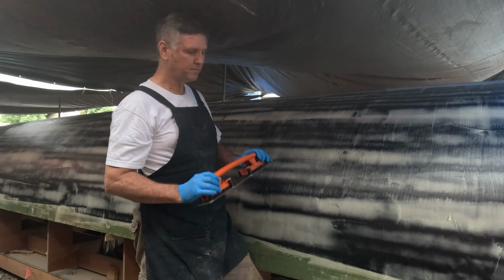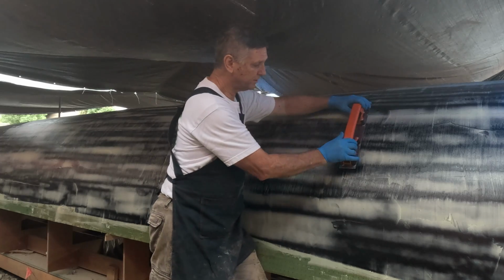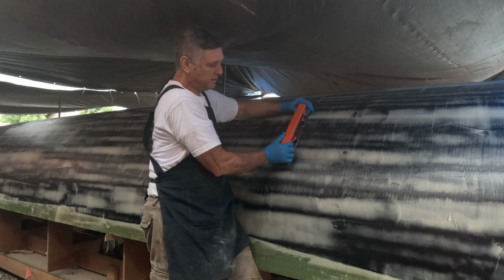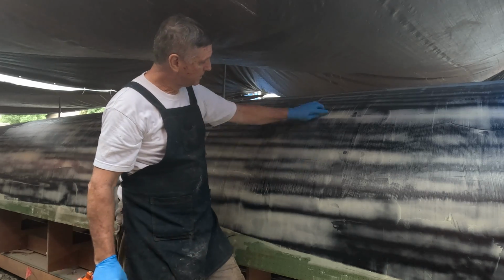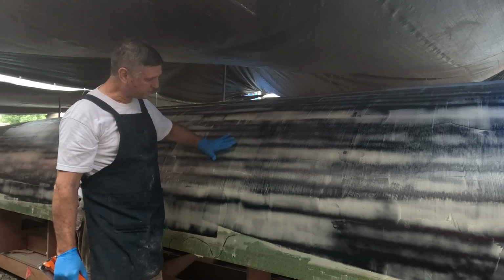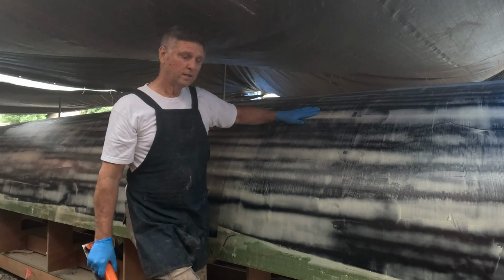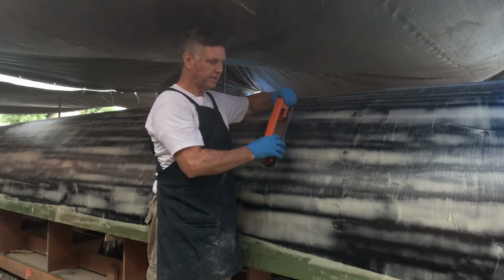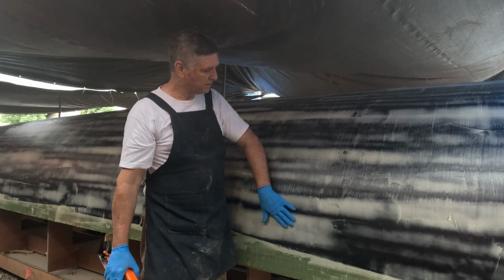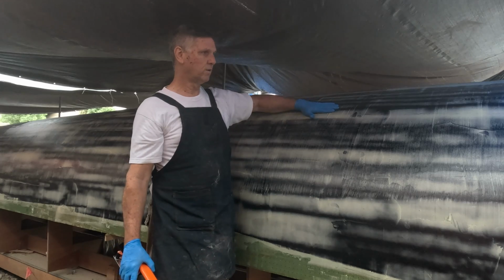But for us, because we have this curved applicator and it'll match this hull, we can scrape this direction and leave those spots here so that this is curved between the high points of the flat panels as I showed earlier. The only reason we can do it this way is because we have these flexible applicators. And this leaves a lot less sanding. I mean, a lot. Because we don't have to take this down that whole 5 millimeters now.